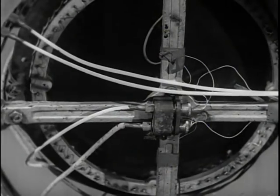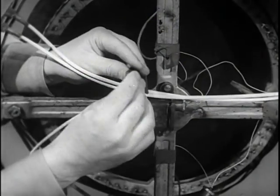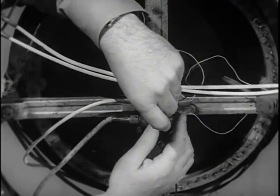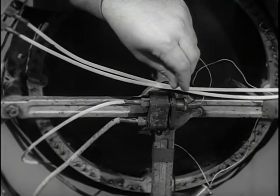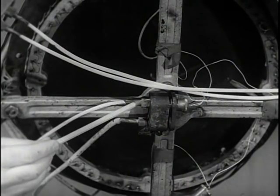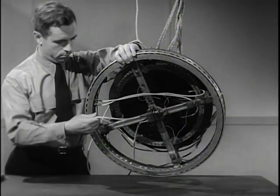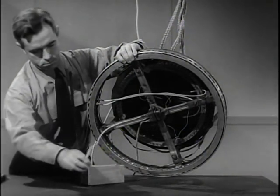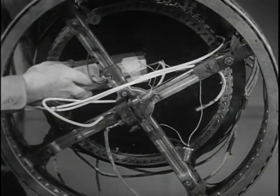The payload passes through this T-hook and is suspended from two blowout plugs in the bottom center of the ballasting ring. When either plug blows, the T-hook is released and the payload falls away. The blowing of the payload plug in the number nine circuit also ignites the fuse leading to the demolition block. On some balloon units recovered, the demolition block has been found not beside the battery on top of the aneroid box, but within the ballasting ring — the logical place for it to do the most destruction to the unit. This region is also a good location in which to look for booby traps.